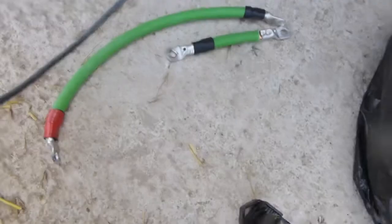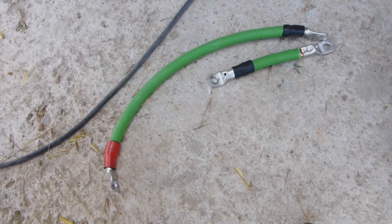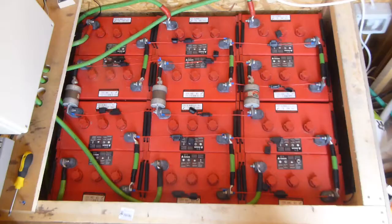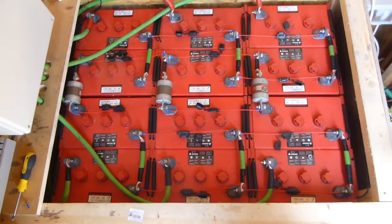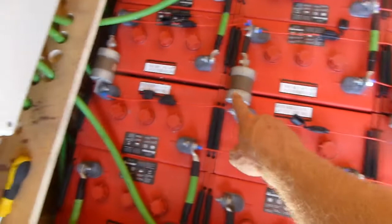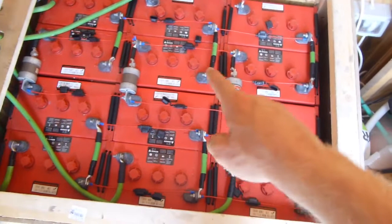I've made these little bridges as well. You can see the difference in the length of cable I have now compared to before — a lot less resistance, and it's just generally better when the cables are shorter. All done — looks a lot better, and now I'm safe. You can see my three midpoint fuses, and the series connections look much cleaner.